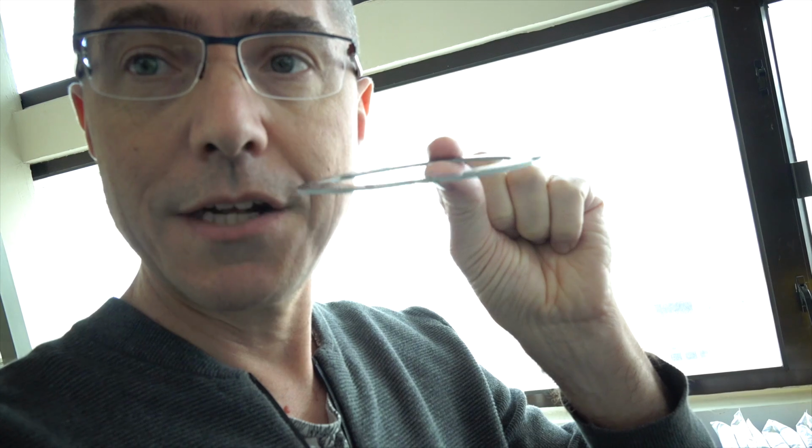What we've done is use this piece of precision fiberglass to space the brass from the portafilter. Now the reason we did that is we have two concerns. One is we want to get that portafilter to fit just right, and because it's fitting in a thread, getting the exact height is not easy. So we've made a whole bunch of different height versions of this to get it right. But also if you've got wear and tear or if you're using a different portafilter, all you need to do is change this one part and the fit of your portafilter in the group head is then adjusted.